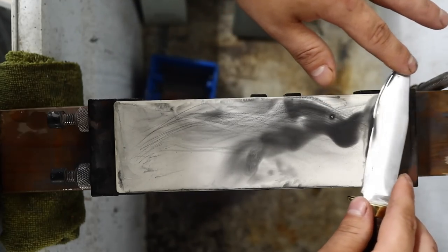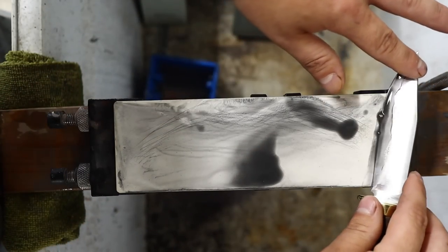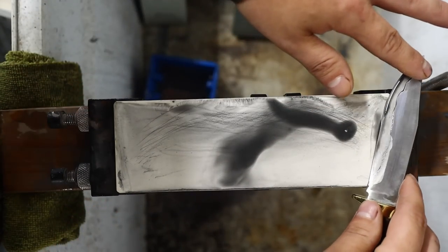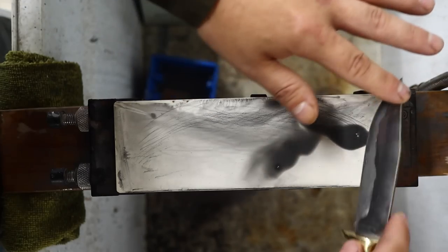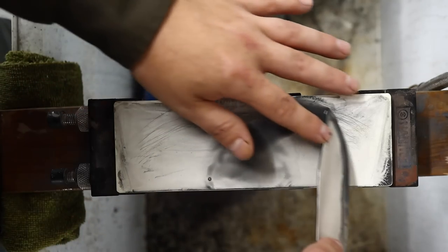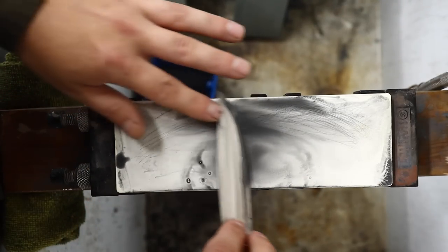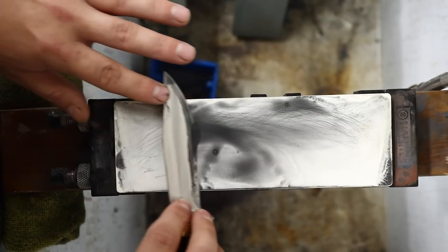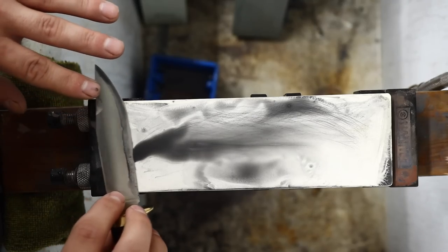I hold a knife to about what it should be for the thickness of steel, the type of steel. You kind of get a knack for it, but I don't get bogged down in a lot of that silliness like some people get carried away with. Because in most cases, it's all meaningless. You invest an hour and a half getting your hunting knife absolutely that exact 19.5 degrees and polished to 6,000, stropped. Then you get to a moose and you make your first four or five cuts and that edge is dwindling away. Your work has been undone. Then the first thing you've got to do is grab a ceramic hone or a little field stone that's maybe 800 grit and tear off all the hour and a half of work you wasted. Very light here now, but let me know what you think of that concept. That's my belief, my standard.